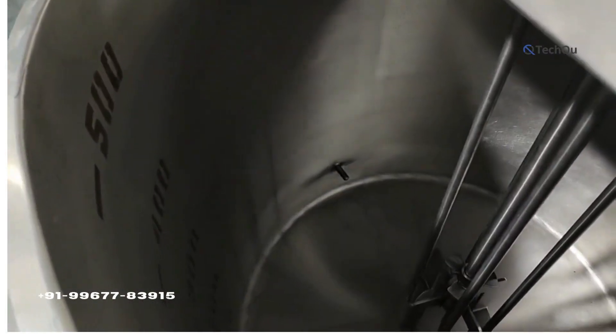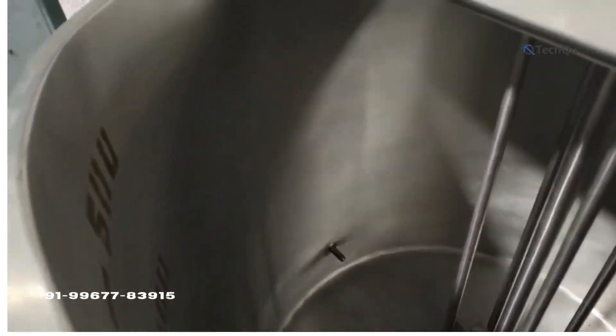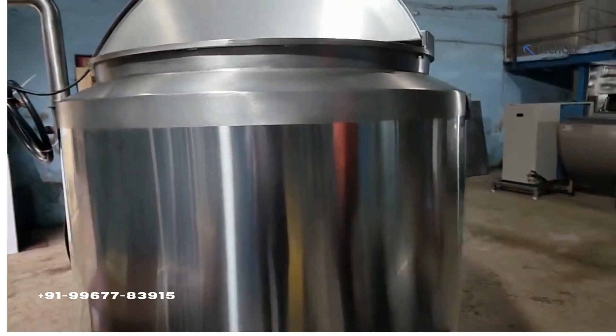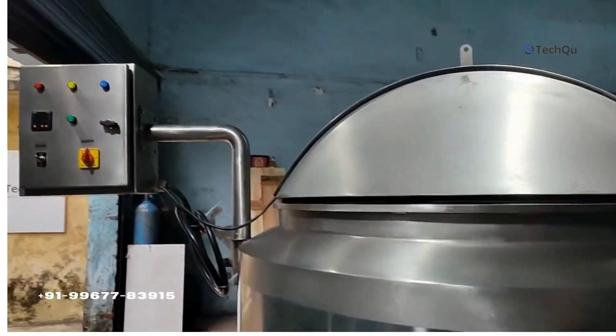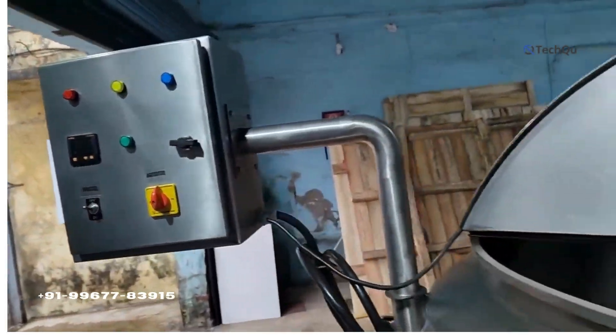The main three core sections of the sugar syrup manufacturing tank are: First section — the tank has three shells. The inner shell contains product, the intermediate shell contains water which we heat, and the outer shell contains insulation. It reduces heat loss by insulating and also maintains the environmental temperatures of your factory.